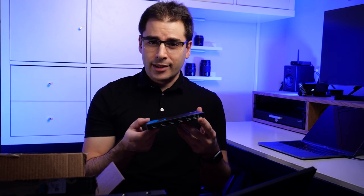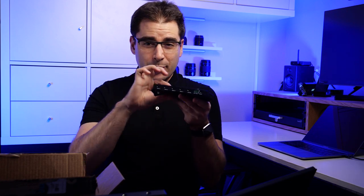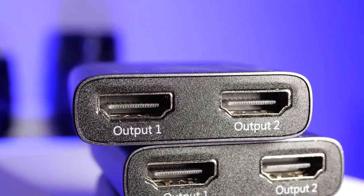It's going to take the four angles from my cameras and create a split screen view, which it can output to a monitor. I spent a while looking around for one of these that was both small and cheap — I didn't want something huge and clunky that was bigger than the ATEM Mini. It's only a little bit taller than an HDMI cable. I also found one that's powered off of five volts, which I'll get to why that's important later. But if I plug a camera in here, I obviously can't plug the camera into the ATEM Mini.